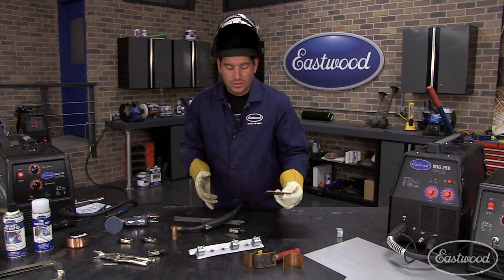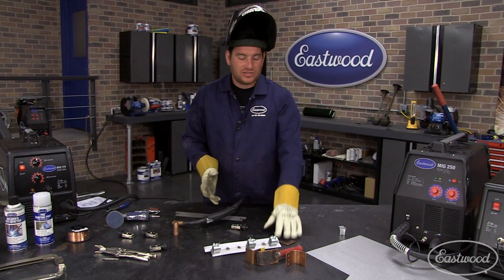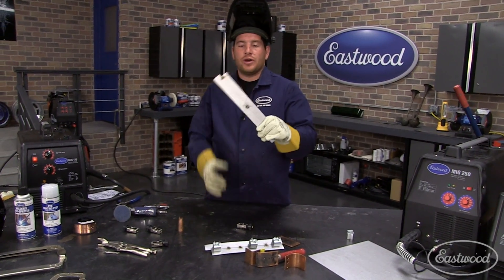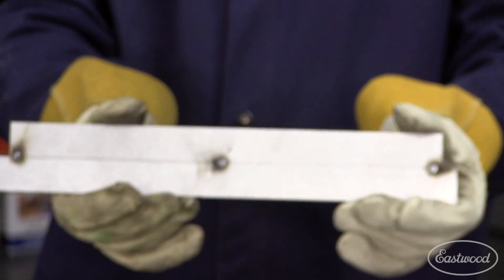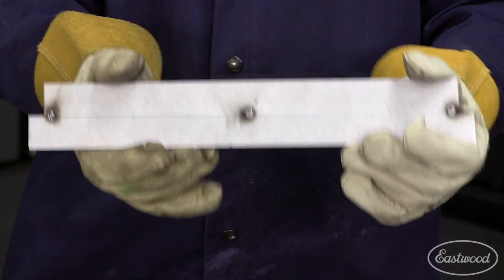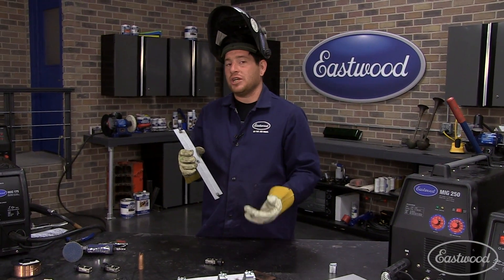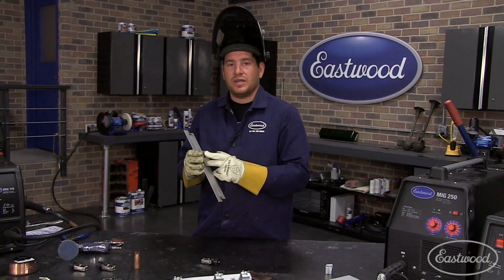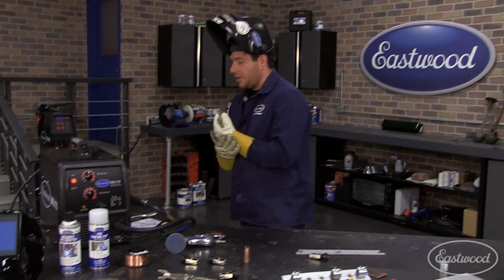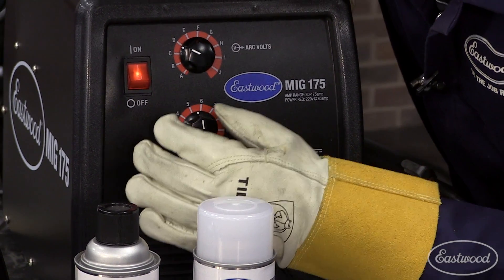So that's welding with a gap — one way to do it. Just make sure you set your gap properly and I would highly suggest using one of these copper backers. The other way is to butt the panels together with no gap whatsoever, like we showed earlier. I've tack-welded this piece together tightly. With this method, nothing wrong with it — you just need to set the machine a little hotter because you're melting between the two pieces to join them. You're almost melting that center area away. So we're going to crank the machine up basically a full setting and one wire speed.